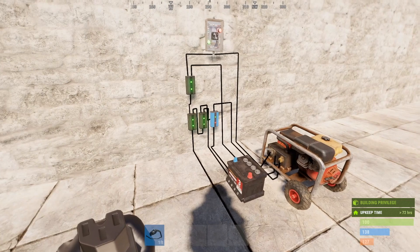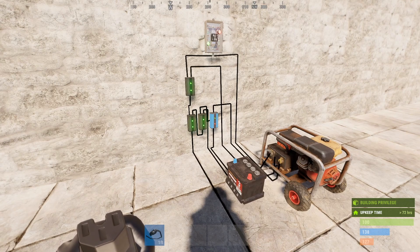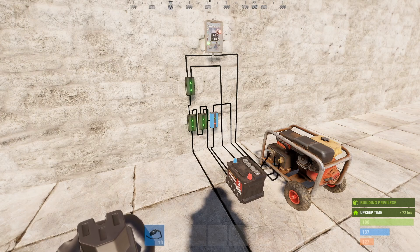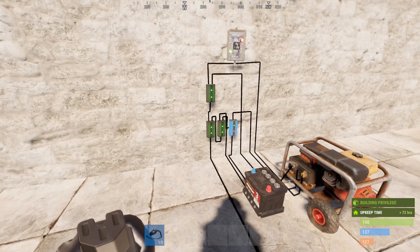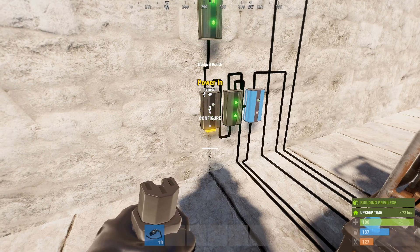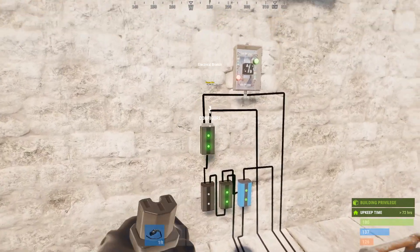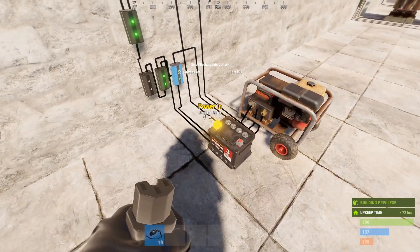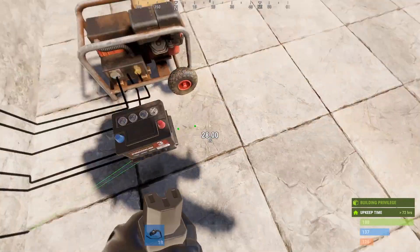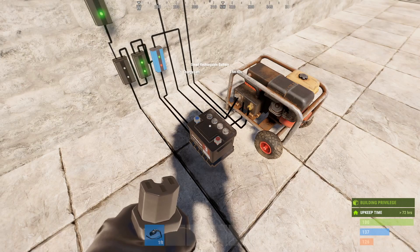I'll just demonstrate what actually happens. Like I mentioned in the explanation, I wanted a way for the generator to start if my power delivery system got cut out altogether. It will also work when power fluctuates — so if you're using solar power and the sun goes down, or wind power and the wind dies down a little — if it drops below what is set into the first electrical branch, which is 21, then the generator is able to kick in. I'll simulate this getting cut out. My power delivery is now no longer in effect — the generator kicks in because it's no longer being stopped by this electrical branch, and the battery is able to start it. If I reconnect the power, then it's going to shut off the generator and start charging the battery again.